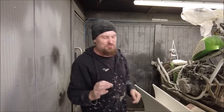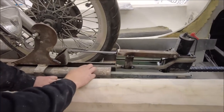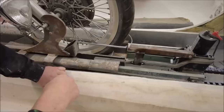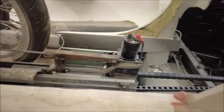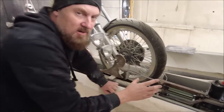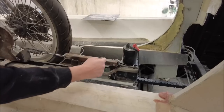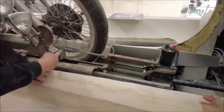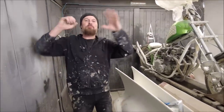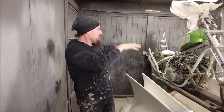So what we're doing, we're putting a gas ram into the mechanism. This is the mechanism - this is the sled that the front wheel rides upon. When this winch pulls this up and holds it there, then you drive the car. When you want to take it off, as the winch releases the tension, this actually pushes the bike back. So we get that sort of push-pull control of getting the bike right to the back of the ramp, and then it can drop down.